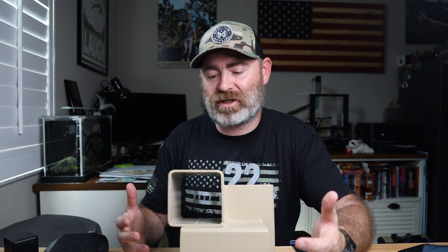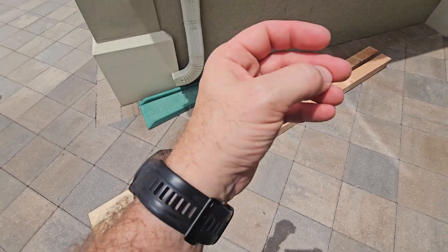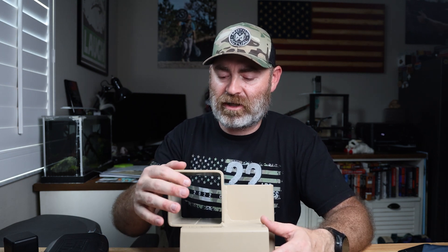it says not to use pressure treated wood. Apparently pressure treated wood is swollen so it's a little bit larger — the perimeter is a little bit larger than the knuckle, so they say not to use pressure treated wood. So I went for the premium wood and it fits just fine. I came home and quickly turned those 4x4x8s into 4x4x4s with a chop saw and marked off the holes.